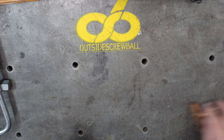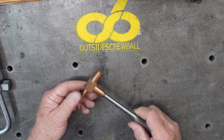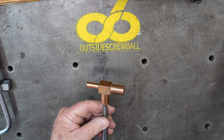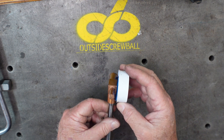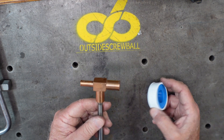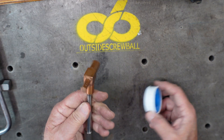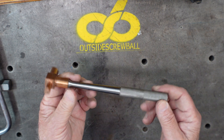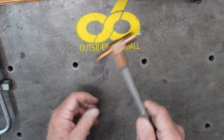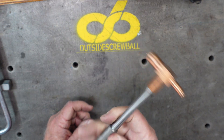Another tool — and these are the last couple. This was a fun build: a little copper hammer that I made. This piece — it was basically a round disk of copper that I had, and it was a real challenge to make this out of just a round piece. Put it in the lathe, did all the work, then mill work on the lathe, and then built the handle on the lathe also. Fun little tool — you can see it's been used. It's got the little beak that you can reach in and tap things. Another good project to build.